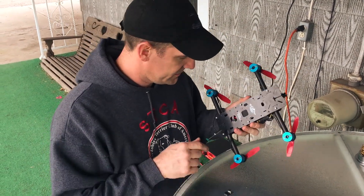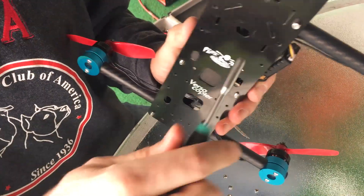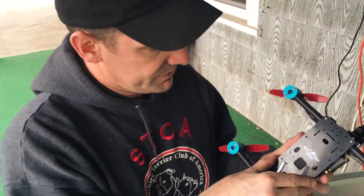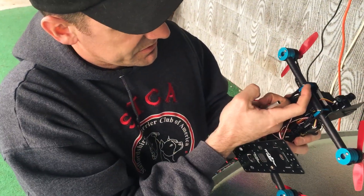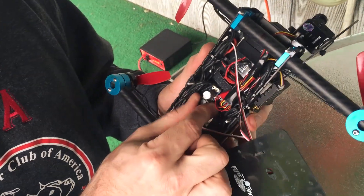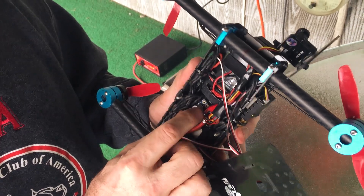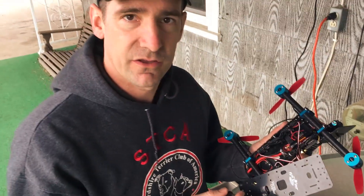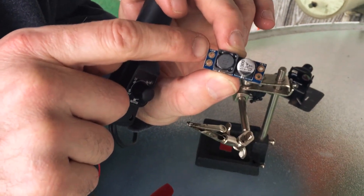So I'm going to take this off. One of the really cool features of the Versacopter is I can pull this plate right off and I don't have to unlock this because the seat clamps are still tight. I'm going to put this little inline filter in here and mount it with some double-sided sticky tape, then solder a lead from the main power in from the battery right to where it says positive in.